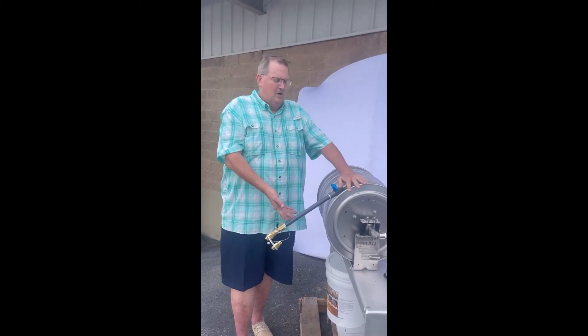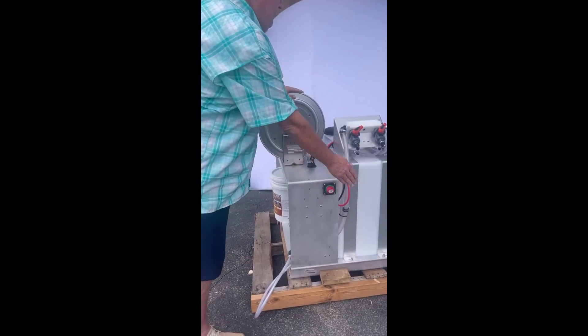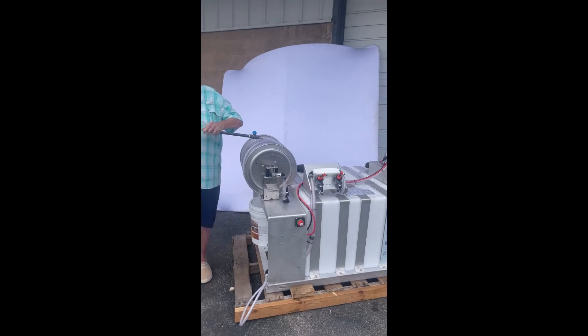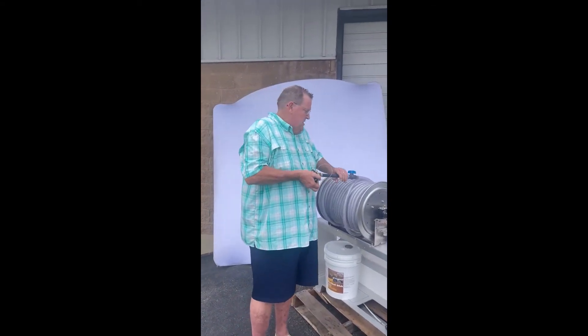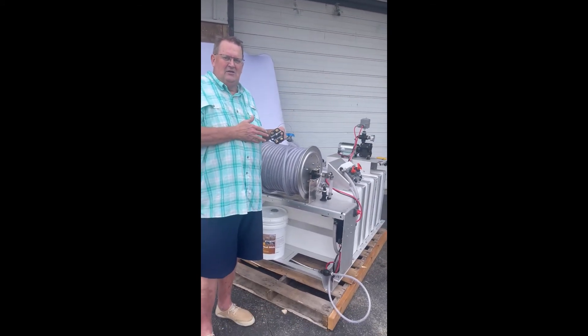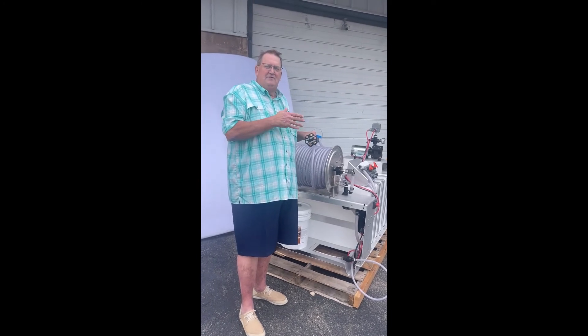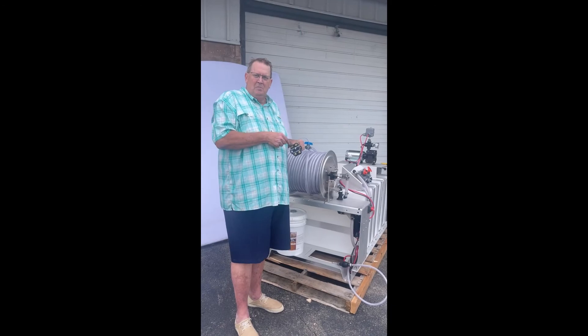When we're completely done spraying the house, it's a real easy process. We reach down here, flip our switch back to the pump that pumps the diluted water on. We're going to change to the biggest tip we have, which is a 60, and we're going to rinse this house down at approximately six gallons a minute at the nozzle. That's going to give you a perfect rinse and make that house look beautiful. Set up and done.